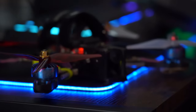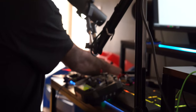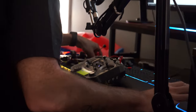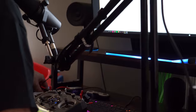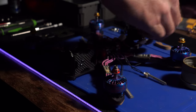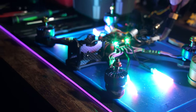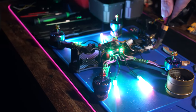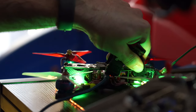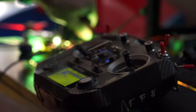One last step — let me show you how to reverse a motor direction. In the motors tab earlier, motor number four was spinning the opposite way. The first thing you're going to do is download BLHeli Suite, Fet Tech Configurator, or BLHeli Suite S — I'll have links to all of those in the description. In my case it's BLHeli. We're going to plug in the quad with the battery, then take your USB-C or regular USB, plug it into the side, and wait for the computer to accept it.